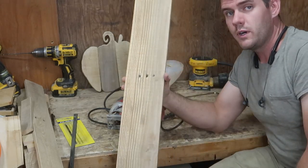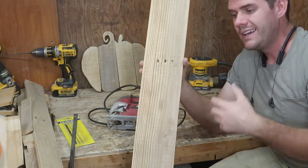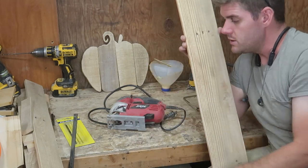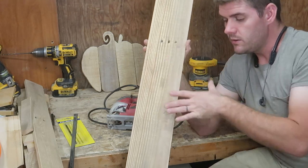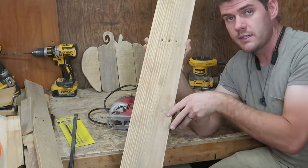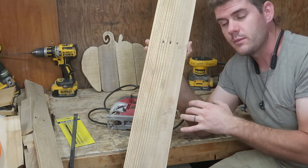So I'm going to use the wider board and do two separate boards, and then I'm going to come up with a face I'm going to draw on it and make cuts with that using either the coping saw or this jigsaw here. And the reason we're doing two instead of multiple pieces is depending on how you articulate the face, especially for the mouth, it may actually connect the dots essentially and either make the center board very weak or it'll just absolutely fall inward on itself and you'll have to kind of come up with a way to rebrace it.